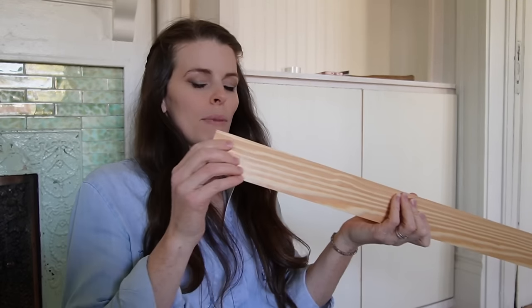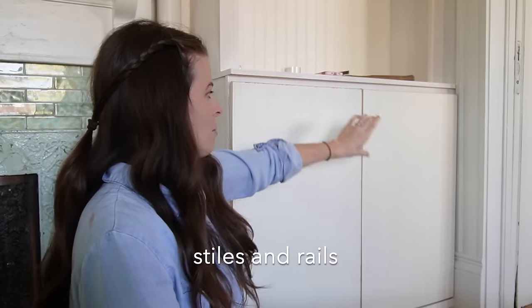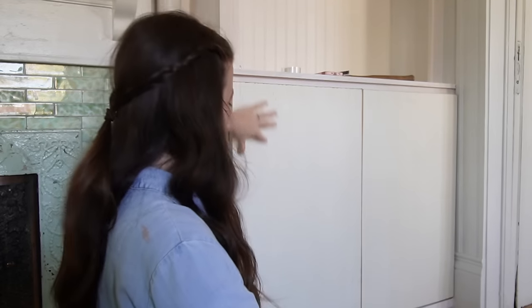Okay, so now I don't want them to be just plain old doors. What I bought was these super thin pine boards — I found long eight-foot ones, which is perfect because I have four doors. I think it's called stiles and something else — I'll put it on the screen — but it's basically that little detail on the sides and top of doors. So I'm just going to cut it down to size, put them on the sides and the tops, then caulk it all in and make it look really good, and then put the knobs on once we paint. Once I do the doors and fix the other ones, the bookshelves are ready to be painted. I've decided on a color and we'll talk about that next.